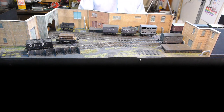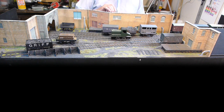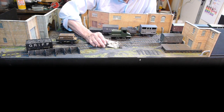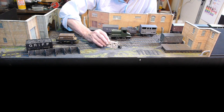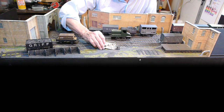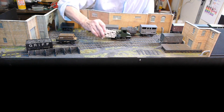I'll give a little demo and explain what happens with a short circuit with the controller. I've got a circuit board here that I use to illustrate my PDF on controllers. You can see a red LED at one end and a green LED at the other. The red LED comes on when I switch the power on; the green one is across the output and pulses with the output — you can actually see the pulses working. You can also see the rather large transistor attached to the end, which has a heat sink on it.